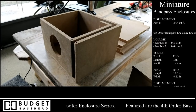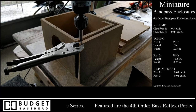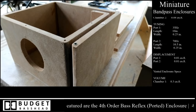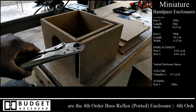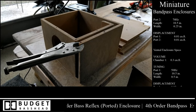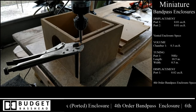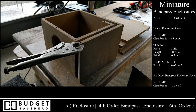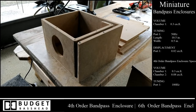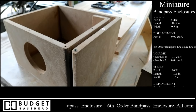So what I'm gonna be doing is using the old trick that I learned from the old schools. Put some pressure on it. Then you can go in it just fine, no cracks. See that? Let you guys see that again. You clamp it down, and what this does is it prevents it. It literally forces the wood to squeeze that drill bit, and the threads of it doesn't force the wood outward. It actually forces the threads of the drill bit into the wood more, so you don't get that splitting.